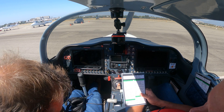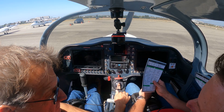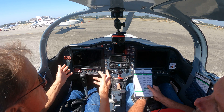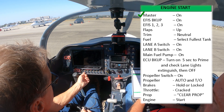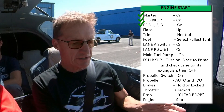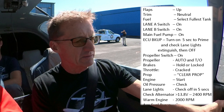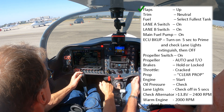So I'm in. One of the things I like to do before I do anything is make sure the brake is on and make sure the throttle is closed. That way, if anything goes wrong — you bump a switch or something and the engine starts — you know it's going nowhere. If you need the list to tell you to switch on the master, you're really not thinking. So I'm gonna switch on the master. On this aeroplane we need to get the EFIS up — battery backup on EFIS 1, EFIS 2, EFIS 3. Things flow in a nice sequence. So you wait for that to boot up, then put the key in but don't turn it on yet. Make sure if you've done your pre-flight by putting flaps down, your flaps are up. Trim — you can check at this point it's neutral.